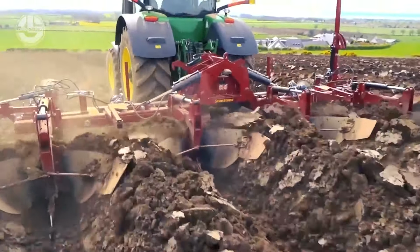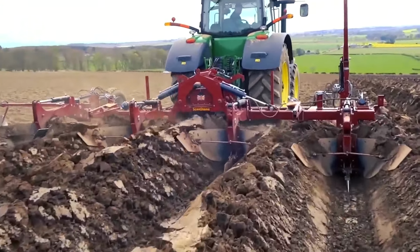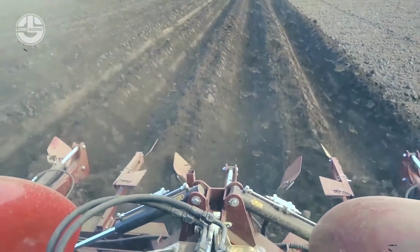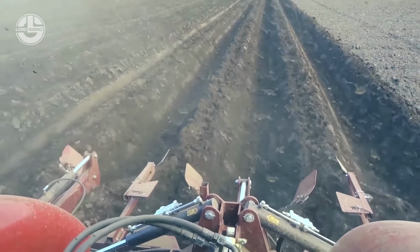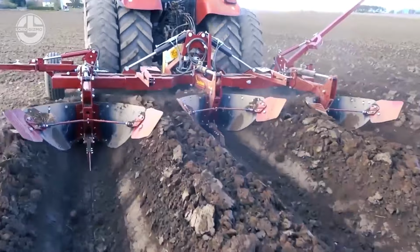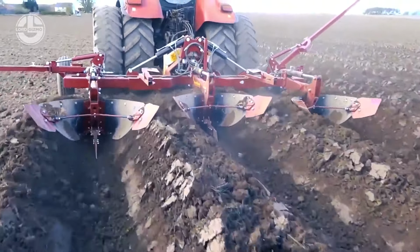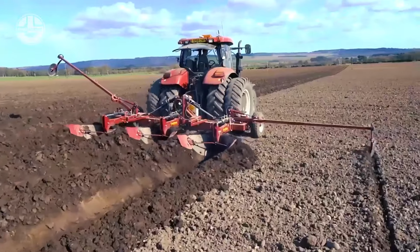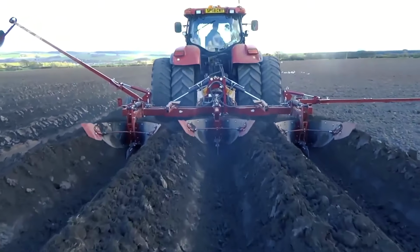The Scanstone bed formers are available in 2-body, 3-body, or 4-body configurations. All varieties can be easily attached to any bed tiller using the 3-point hitch. Additionally, they boast an adjustable track width setting that ranges from 4.9 to 6.6 feet, making them highly customizable implements. In addition, the Scanstone bed formers offer optional features including disc or point style markers, stabilizer fins, large tailpieces, and cultivator tines.